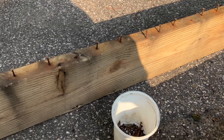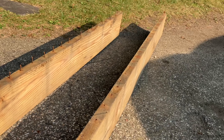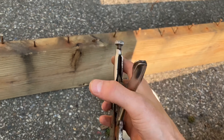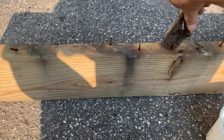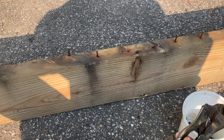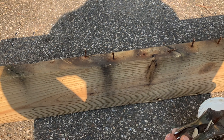What I'm doing now is pulling all these nails out. I've already got this board done. The way I'm going about it is just taking a pair of vice grips, gripping a nail as close to the board as I can, just clamping it and rocking it back and forth until it breaks. That's the easiest way I've found to do it — I've tried pulling them with a hammer but these nails are so old and rusty they just rip the head off.